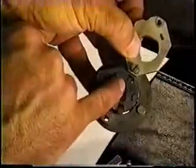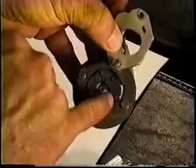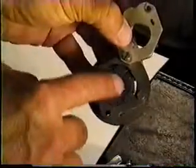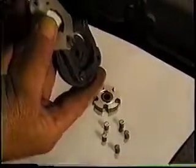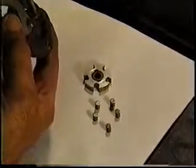In a moment I'll take it apart and show you what the damage is, but for the moment suffice it to say that this produces extremely high pressures by virtue of the fact that hydraulic pressure sneaks in behind each one of these individual ball bearings. They're little flat cylinders stuck between the outer rotating assembly and the inner rotating assembly. I'm going to dump these out and pull them out over here on the paper. Each one of them is just a little cylinder. This piece here never seems to wear out, but what happens is that water will get down right here, and it'll start to chatter, and it causes the ball bearing to want to hang up.